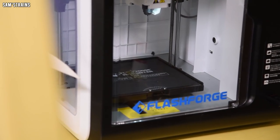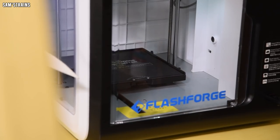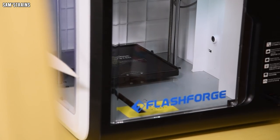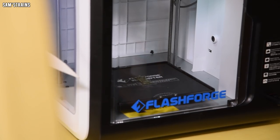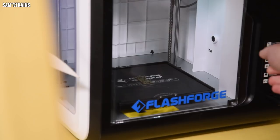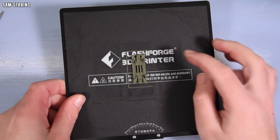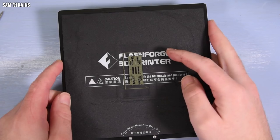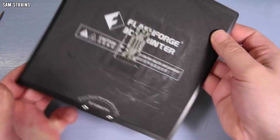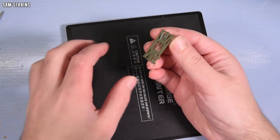All right. I've just caught the end of the chassis, and it looks like all my fears have not come to pass. It looks as though the axle boxes and the springs have at least printed. They are at least there. I don't know what sort of quality we're dealing with at the moment, but let's pull this build plate out and let's find out. So the chassis has warped a tiny little bit. I think it's this corner, but that's nothing to do with the scale. That's just because I haven't tested this, really. I haven't refined it. I think if I change the layer height, I should be able to, you know, fix the warping there without any problems.